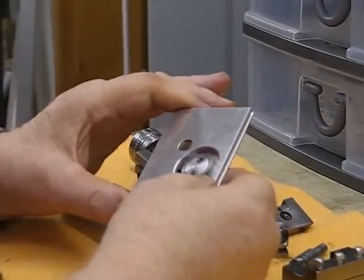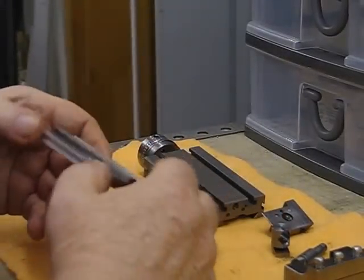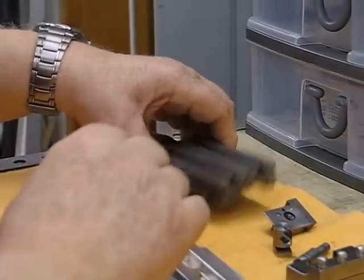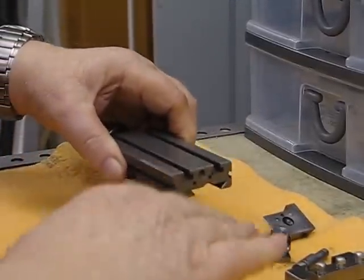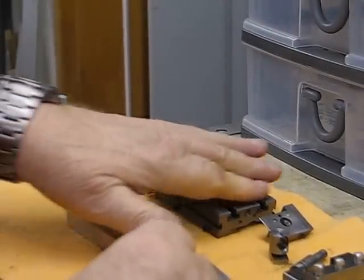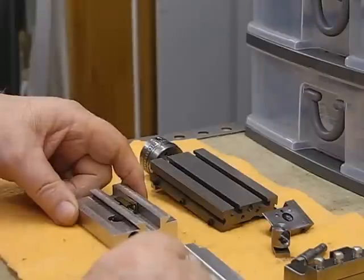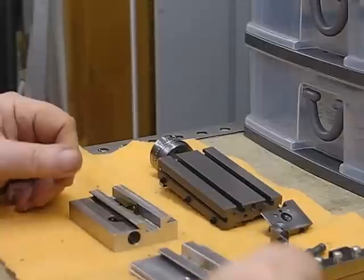That's what I did to modify this flimsy little thing that they produce. Now the problem was that increasing this block by a quarter of an inch raised the top surface of the top slide table up a quarter of an inch higher. That meant I could no longer put a tool bit on the top surface and clamp it to do any machining.